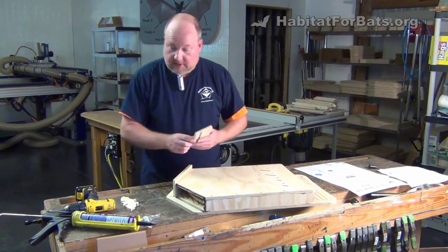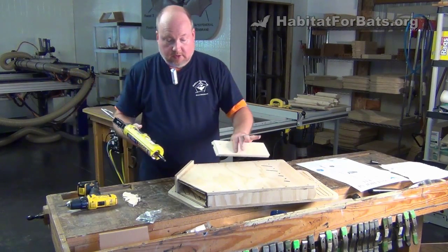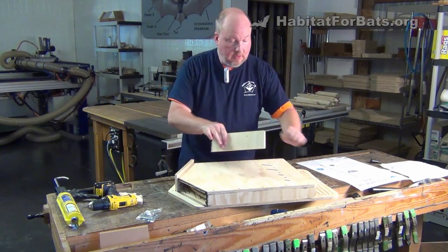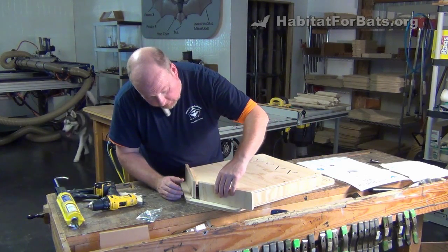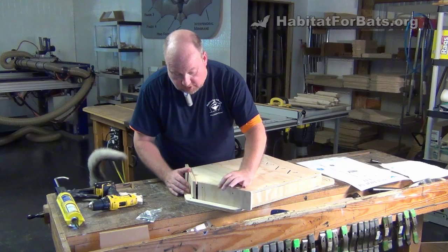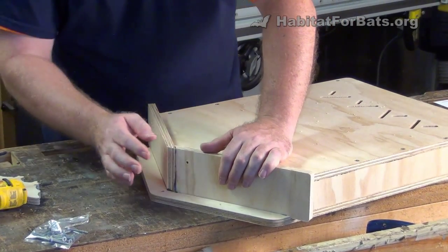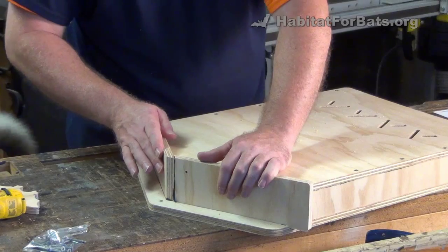Here's one of the reasons I like to put that panel on first — we still need to caulk the peak. On the short panel, before you install it, just run one more bead of caulk along the edge. Install it just like the front panel, but leave a little bit of a gap, then fold it on. Gently pull it forward to close that gap up — now that seals the peak. It's okay if this panel is a little proud of the other one.